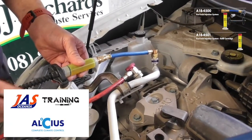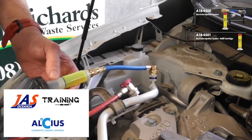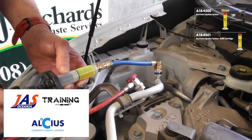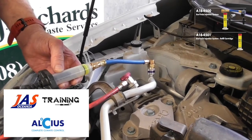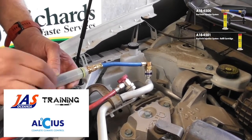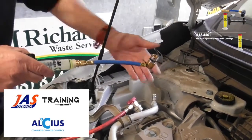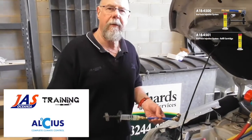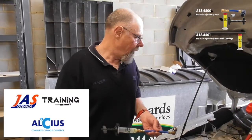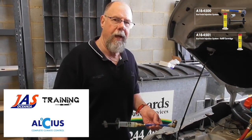We can actually hear that it's pulling it in itself. I can screw it in as well, but it's actually pulling it in quite well by itself. Pull the LeakGuard in. I'm going to remove the injecting tool. Let it sit there on the high side for a little while so it pulls all that LeakGuard into the system. Once it's been sitting for a while, I'm going to reconnect the low side, evacuate it down, and refill it with gas and we'll see how it goes. Thanks.